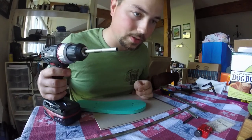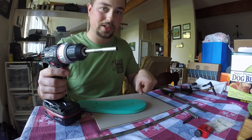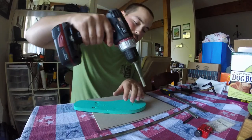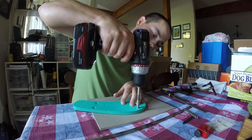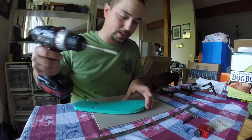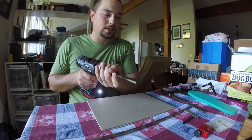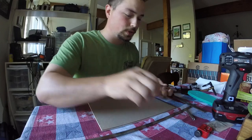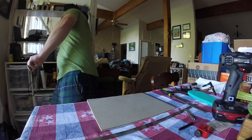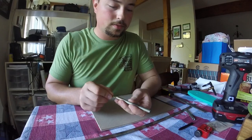Take your tool, make sure it's nice and centered in the chuck. This is kind of a trial-and-error thing, but I find that the less downward pressure you put on it, the cleaner the cut will be. If you sharpen it up well, it does not take much pressure at all. You just want to line it up vertically and it cuts — see, a perfect hole right in the foam. Back it out with a little brass rod and you just pop your piece of foam out.